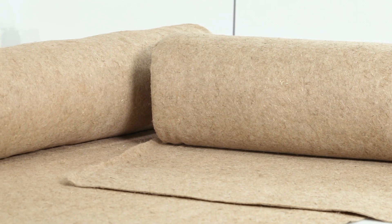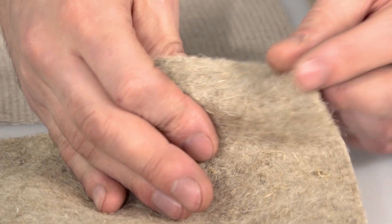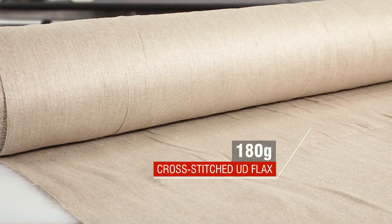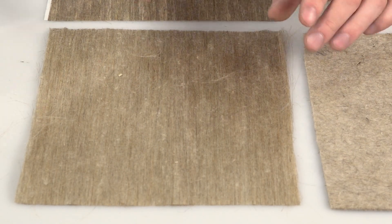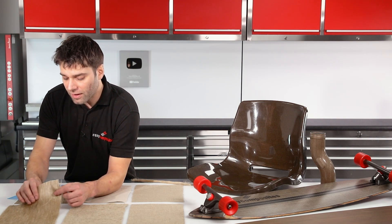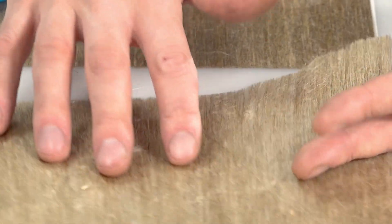Looking at the non-wovens, we have two weights: 300g and 450g. These are short randomly oriented strands, so they won't offer particularly good mechanical performance but are very easy to manipulate into contours, making an excellent core material given their low density. Then we have the stitched unidirectional at 180g, which has a very light cross stitch holding the unidirectional fibres together — quite a robust material to work with. Then there's the bound unidirectional, which has just a light binder keeping the fibres together, available in 50g, 110g, and 200g. These are quite fragile to work with but have a very nice almost plywood-like appearance in a layup.